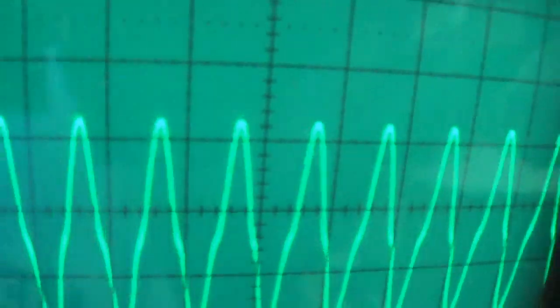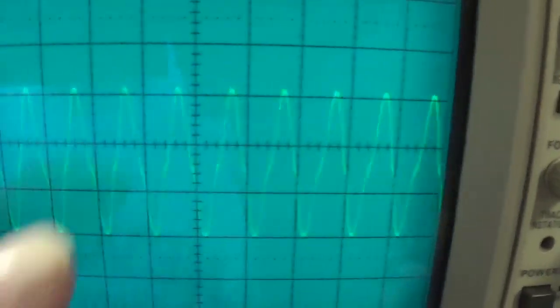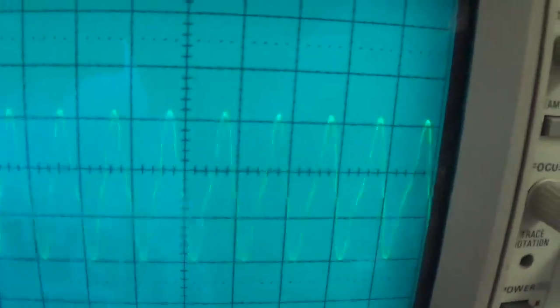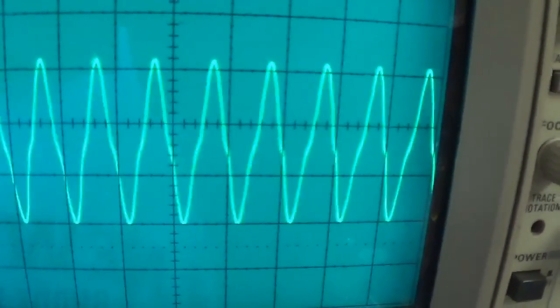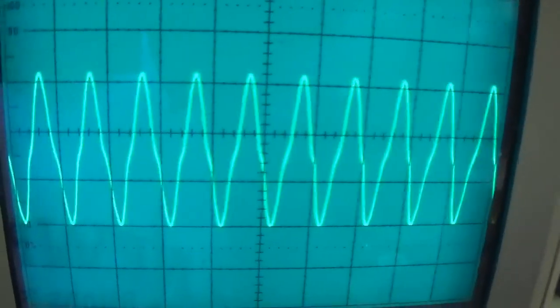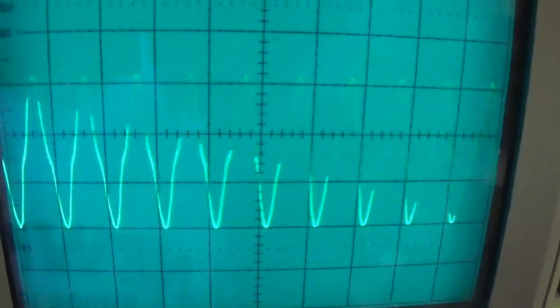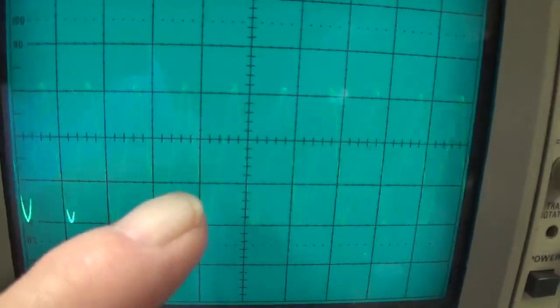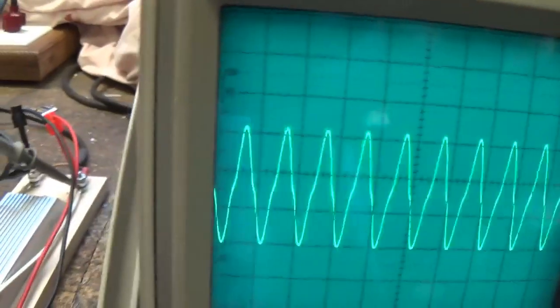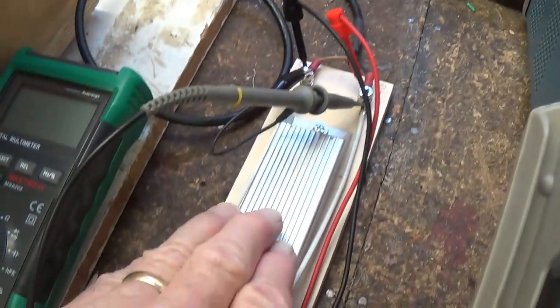And it means then that the highest and lowest output of the amp is being clipped. It happens at the bottom end also. And believe me, it doesn't sound good. Now that's the type of distortion we're going to use to determine what the peak output is of our amplifier at each of the four bias settings. I will crank up the amplifier volume until we see clipping begin, and then I will write down what the output voltage is of the amp into our dummy load.